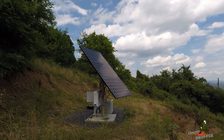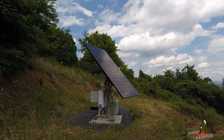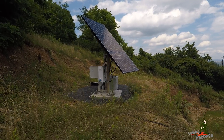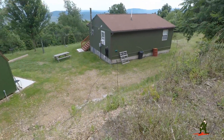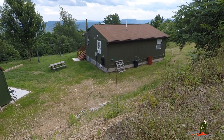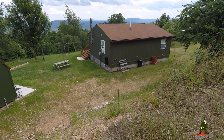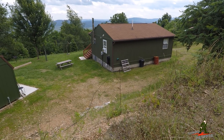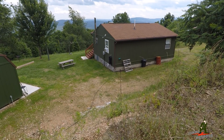This is our off-grid solar power system out here at the cabin in West Virginia. I have three Kyocera KU-265 panels. Everything is local to this position. I convert DC voltage to AC voltage and then feed it down to the cabin on a very large extension cord that I drag across the hill when I need it. That plugs into the side of the cabin into an outlet connected to a six-breaker manual generator transfer switch. That transfer switch allows me to toggle six circuit breakers between commercial line power and emergency power — but instead of a generator, I'm connecting off-grid solar power.